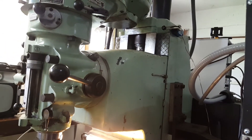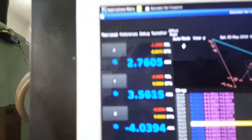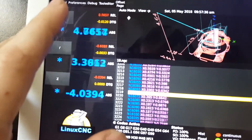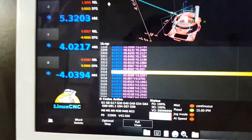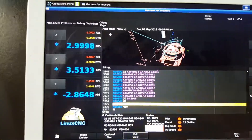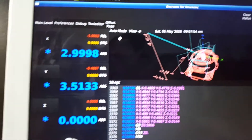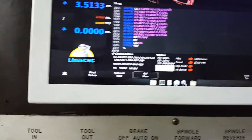I played around with it and couldn't figure it out. Another complaint for my axis — I don't know if this was fixed in an update — this coordinate display is not the real number, it's actually multiplied by two for whatever reason. So I went into MDI and programmed a G53 move and it gave me the right coordinates. The machine is actually moving in the right direction in the real world, but the display is giving me a false read.